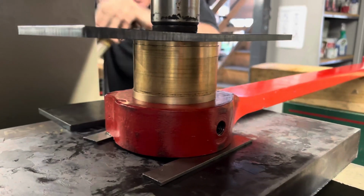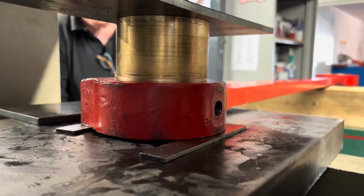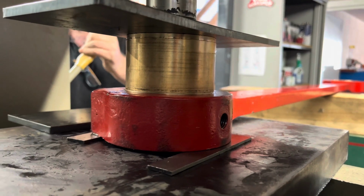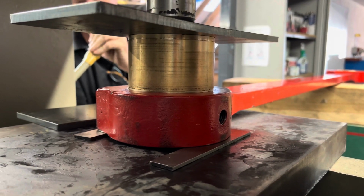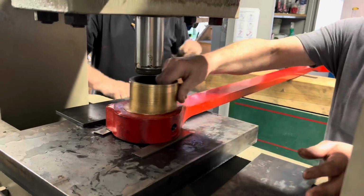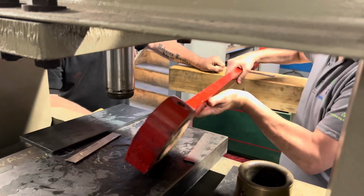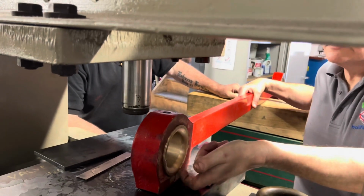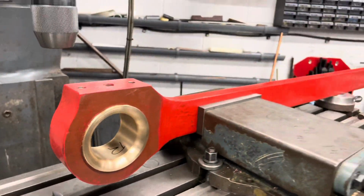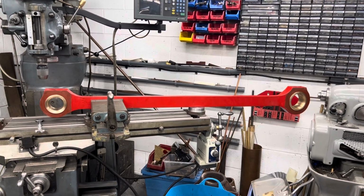Pressing in the other end, you can see that's nearly all the way down until it goes solid. Neil will then flip it over just so that he can check, as he did on the other end, that it had gone in completely square and true, and that it had all gone down to the right area it needs to be. You'll see when he does flip it over that there's a smooth radius in the other end of the bush. And that's because that goes up against the root of the pin itself, which you perhaps remember from the view earlier is also radiused. Generally speaking, a square straight edge on a pin or anything mechanical is a fracture weak point, a point where all the stresses can get localized, so it's much better to have a smooth radius at any potential angle than any other shape.